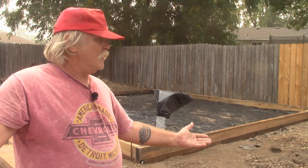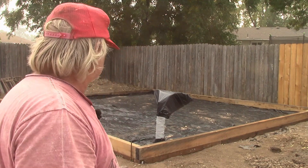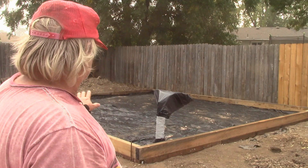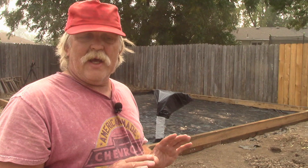That's where we stand today. The wind has shifted a little so the smoke isn't as thick; I've been able to work a couple of hours a day, light work, but it's still pretty smoky. That's where we'll end this video. In the next video I should have the completion of this pad for the new shop shed. What I have left is to install the dead men — the braces that keep the perimeter from bowing out as I add gravel — then move the gravel in, rent a plate compactor, and compact it down to lock the gravel together nice and tight.